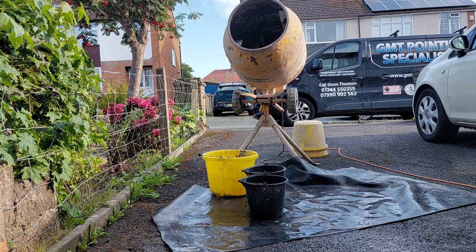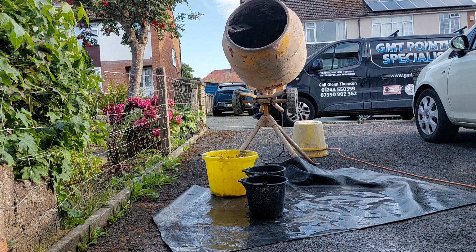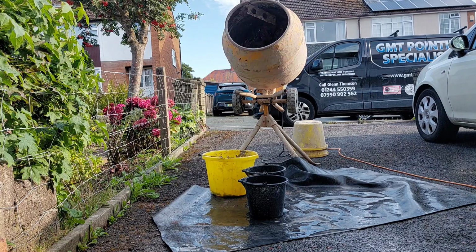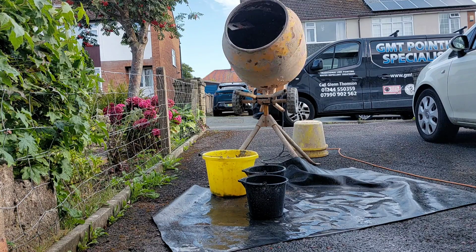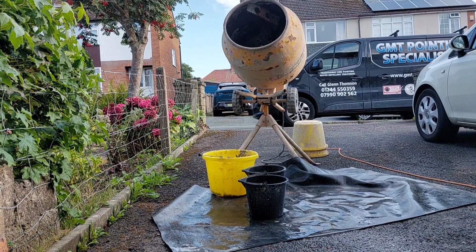So when I'm working with lime, I always wear my gloves, my mask, my glasses, and any tassels that I have on my hoodie, I always cut off so nothing catches on that mixer. And when I put that last bucket of sand in, I stood to the side of the mixer, so anything that comes out will bypass you. So you just, again, you just don't want to be breathing that in. So I'll leave that mix for 5 minutes.